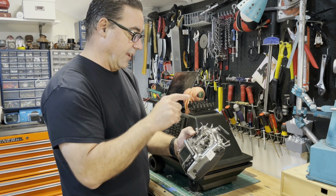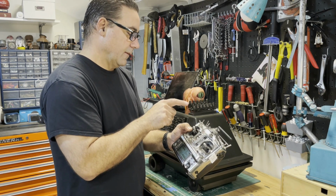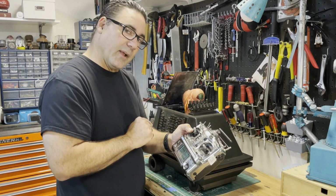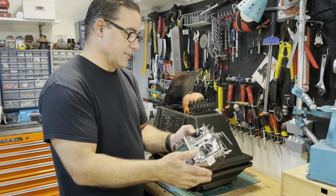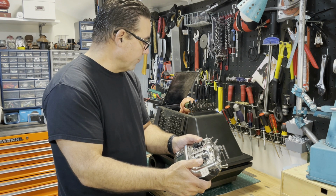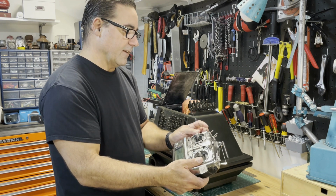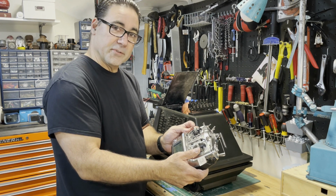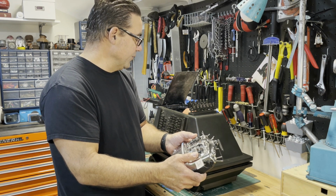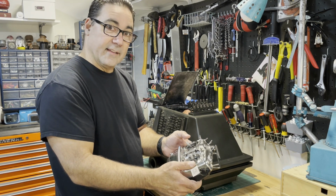And then the other part of this is that the lift mechanism on the robot is here. There is a 3-position switch here that allows me to go halfway down so the Dianoga looks like it's maybe peeking out, or hiding right before it goes in, or if it gets scared or something like that. And then if I go all the way down, or the 3rd position of the switch, it goes all the way into the cavity. I'm still able to move and position and nod and do all that stuff inside of the cavity.